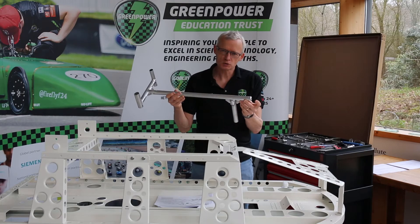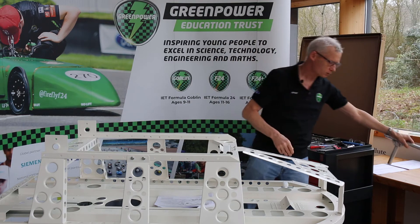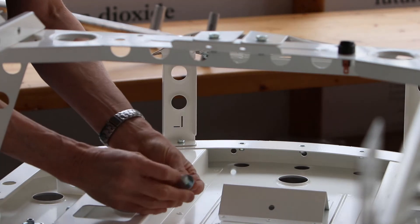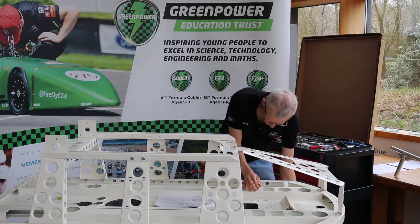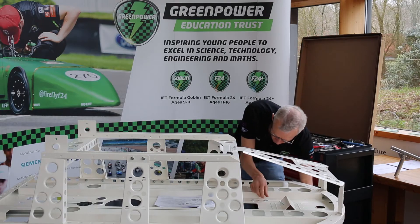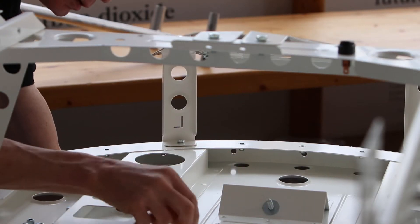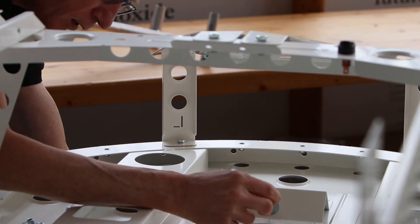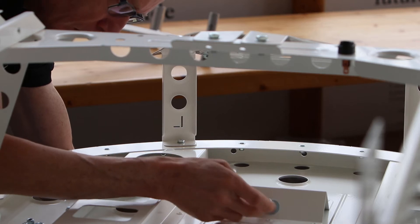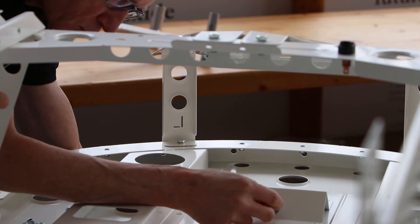What we're going to do is position the bolt that goes into the bottom of the steering column first. I have the bolt here — we put a big wide washer on it to spread the load on the bottom plate, and come up through this hole from underneath the car. Then another wide washer again to spread the load, then a plain nut wound on most of the way but left loose so the bolt can still be turned and moved around. Then we sit another washer on top of there.